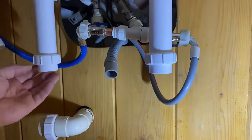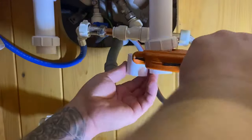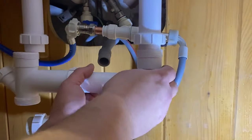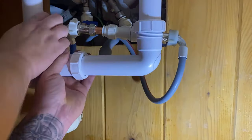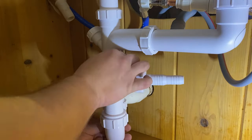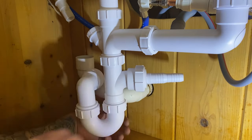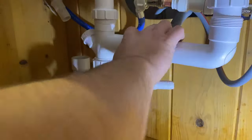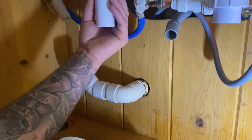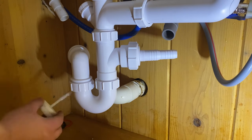It's a shame there's no pipework we can cut back to make it fit. In this case we're actually going to have to add on some elbows — add some fittings to raise up the pipework and lift that trap up higher so that we can come up and meet it from our outlet. Unfortunately it's all very very tight and I've got nothing I can really cut back. We just need to measure up, put some fittings on, go just slightly higher, and then we can come straight into that trap.